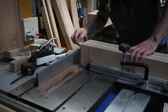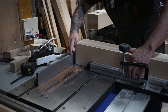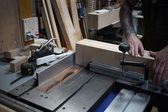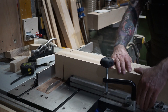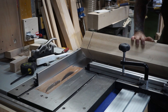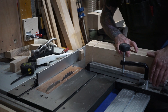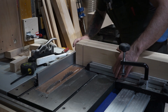I make sure to cut the shoulders at the table saw. I align the knife mark with the edge of the blade, place a small block at the end and then set the fence to the small block. From there with every cut I can simply place a block next to the fence, slide the workpiece up to it, then remove the block and make the cut. This ensures that the position of the cuts is consistent and repeatable.